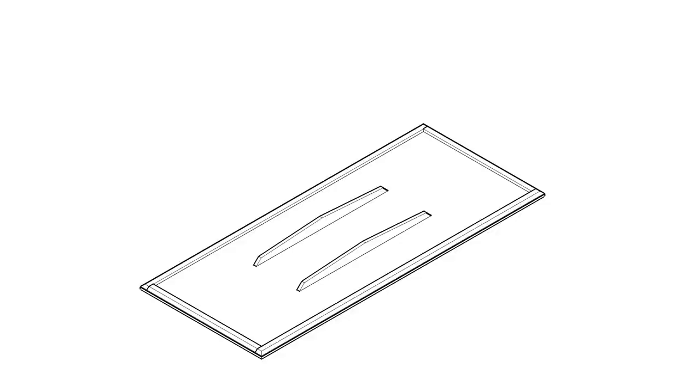In this chapter we're going to start breaking our plywood down into what's going to become the finished top. If you wanted to build this the easiest way possible, you could get two pieces of plywood, glue and/or screw them together, attach the legs, and call it a day. But we want to do it using only one sheet of plywood. Looking at the top from the underside, we're going to start with one large top piece, then have four perimeter pieces to give the top a thicker look, and then two support pieces — I call them belly pieces — to help prevent the table from sagging.